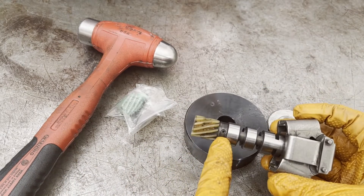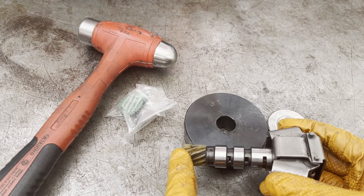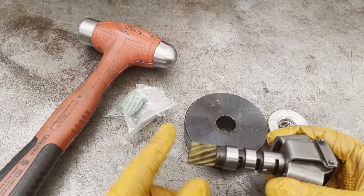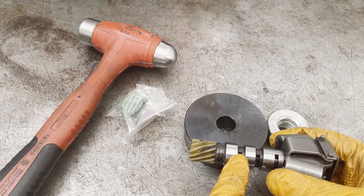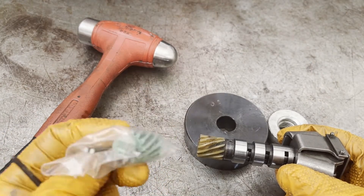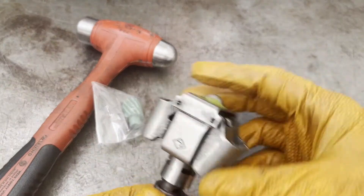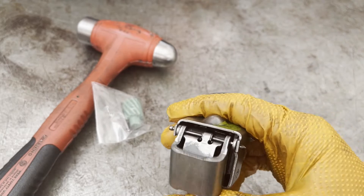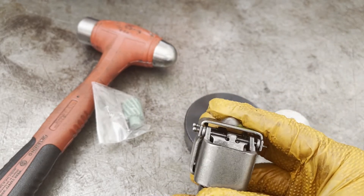So what we want to do is remove this roll pin, get this gear out of the way, and then get the valve out so that we can recondition this bore and, if necessary, smooth out or recondition the valve a little bit. Then we have a new gear to install along with a new roll pin, and new weight rods — levers, whatever you want to call them.